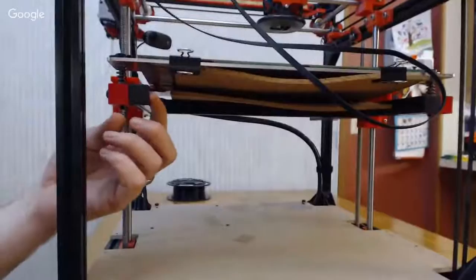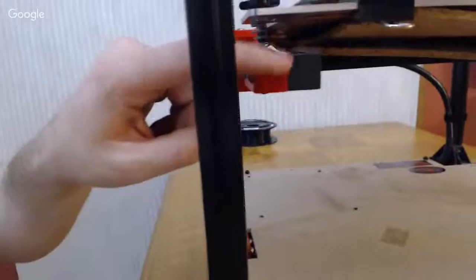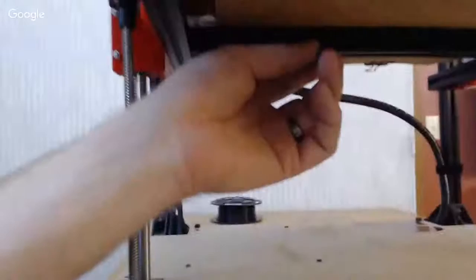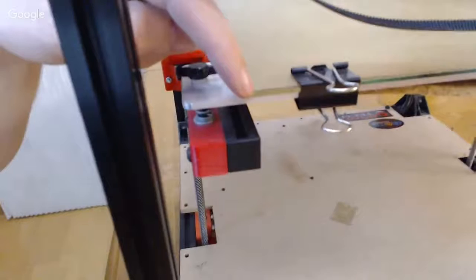But I think ideally, and in the long run, what I'm going to want to do is do like Walter did on his bed design, where he actually put a support at the front and at the back, but bolted to the front of this piece. Because what that gives you is a degree of freedom to adjust this in relation to all these printed parts of the subassembly where it wants to be, instead of forcing it to where it has to be because this is fixed. The other thing that would do is let you not have to buy this expensive machined piece of aluminum there. The bed would just come out here, like on Walter's, a little bit further. It would be a square piece, and so long as you could get a square, flattish piece of aluminum and drill four holes with a hand drill, it could be a cost savings.